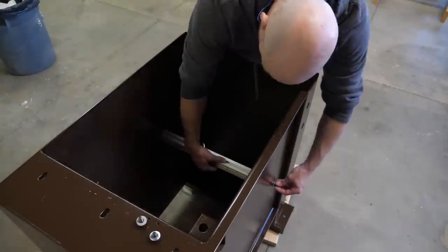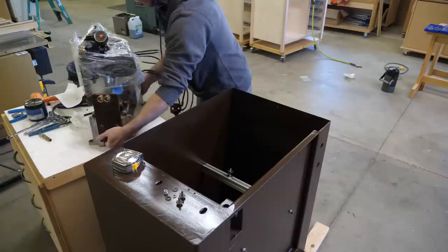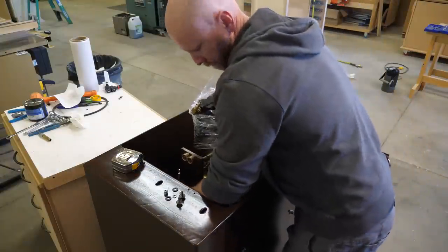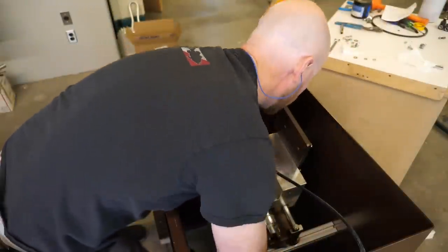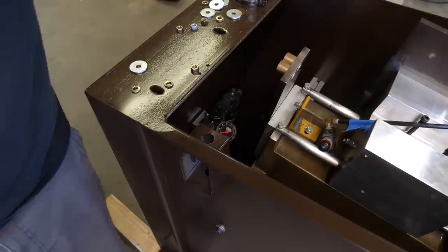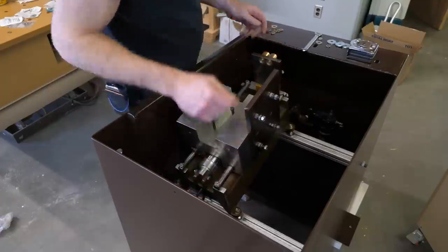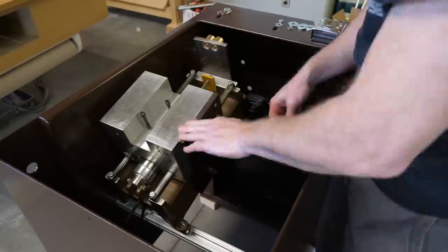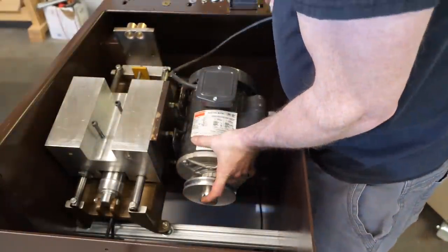It's now time to install the drill assembly into the case. These are the crossbars that the main drill assembly mounts to. I use plastic wrap to prevent stuff from flopping around and route the pneumatics carefully — I had everything assembled out of the machine, so I needed to make sure they went back in correctly and wouldn't be tangled. There is some lateral adjustment, so I get that set and then correct my earlier mistake: I had put the motor mounting plate on upside down. With that grievous, egregious mistake fixed, I throw in the motor.